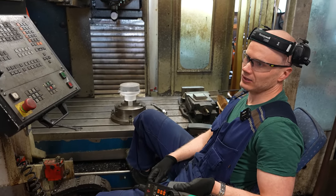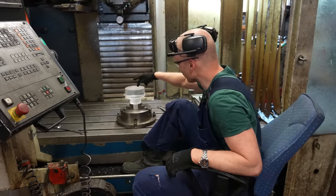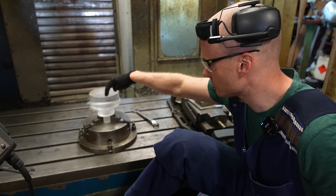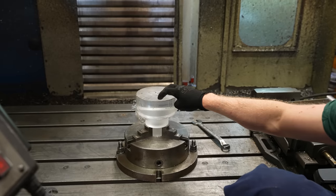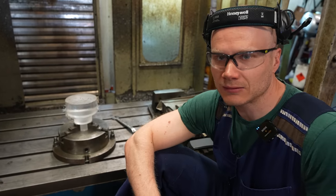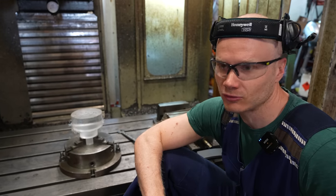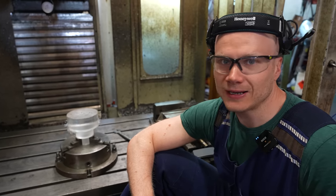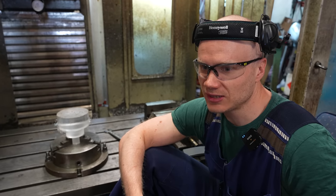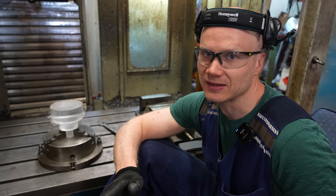And earlier today we talked about how many holes we are going to have. And I think we are going to have just one row of holes, because if you have two rows, it's going to be difficult to see what's happening when it's crushing. So just one row, and we want to make them relatively large, so we don't have to use super much pressure and explode our tools. So I think we are going to start with 6 millimeter holes, and if that looks bad, then we can try different types of tools to make them larger and get better finishing there.